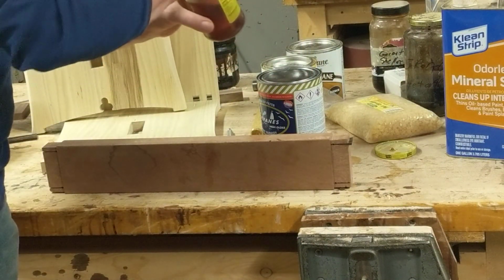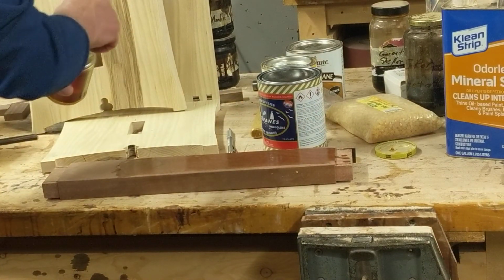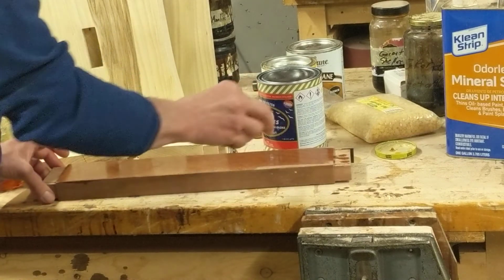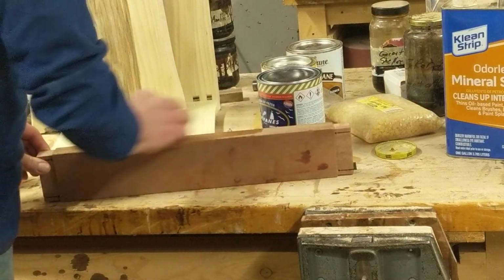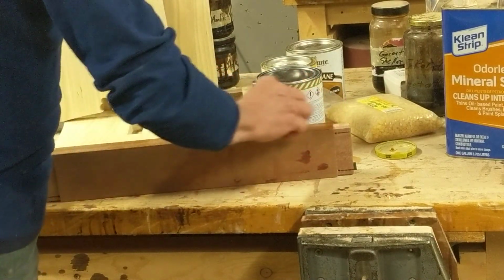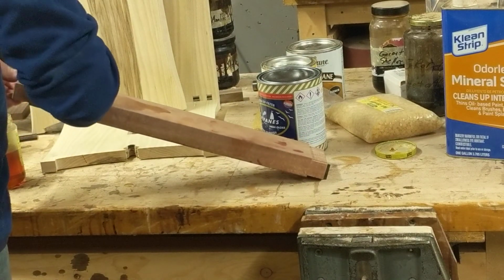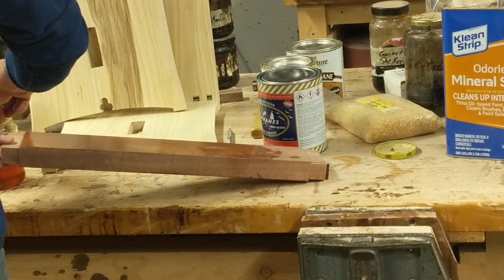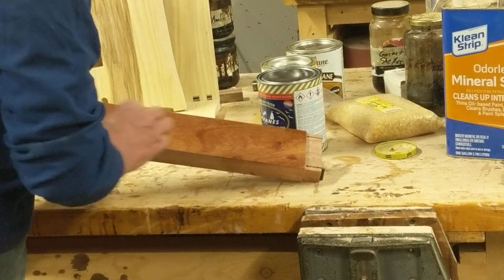Okay. So I'm going to step to this side. And I generally like these oil-based finishes on darker woods. It just leads to a nice warming effect on it. Also what I'm going to be careful about is I don't want to get finish on any area I'm going to glue. If I do, that glue is not going to be able to adhere over the finish. The one exception would be the shellac, but still I'm counting on the wood glue to penetrate those small pores in the ends of these cells and be able to create a stronger bond. Even shellac will fill those pores, and that glue surface is not going to be as strong as it should.